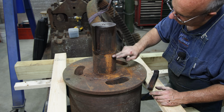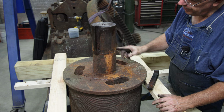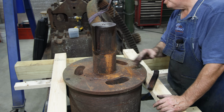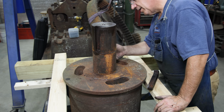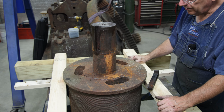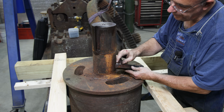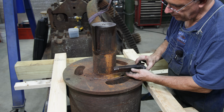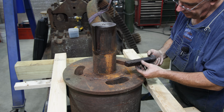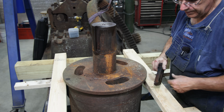Now down here, this is the bearing surface, and this is the part that we're going to have to turn. I won't turn this area so we can get that gear back on it, but we are going to turn and freshen this area right here up for new Babbitt bearings. It's not in bad shape, but it's bad enough that I think we're going to need to take probably 10 or 15 thousandths off of it. The other side is very similar, but also there's the key, and it was hung on something, and you can see we moved some metal as we were pressing that thing apart, but it came on out. So we'll clean that up, and that'll probably get reused. No reason not to, I don't think. So that looks good.